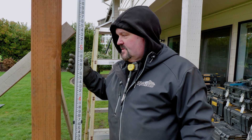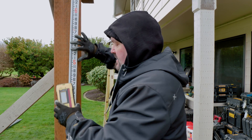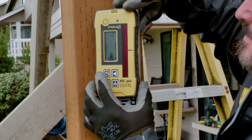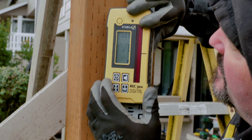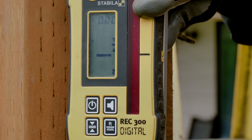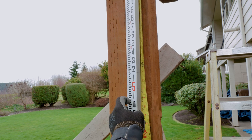Let's check that out and see if that works. Normally, let's just say this post wasn't installed yet — I would put my elevation stick right on top of this footing, sitting on this saddle. Just for giggles, I'm just going to say the ground is my saddle. I've got my elevation stick right here, I've got my receiver. It's telling me to go up — okay, I'm too high, come down. Now I can kind of see the reflection of the laser. It's very close to this line in this red area right here. I'm dead on. There's my line — we know it's 25 inches, our constant measurement was 25 inches, so I should be close to 25 inches. There's your 25 inches.